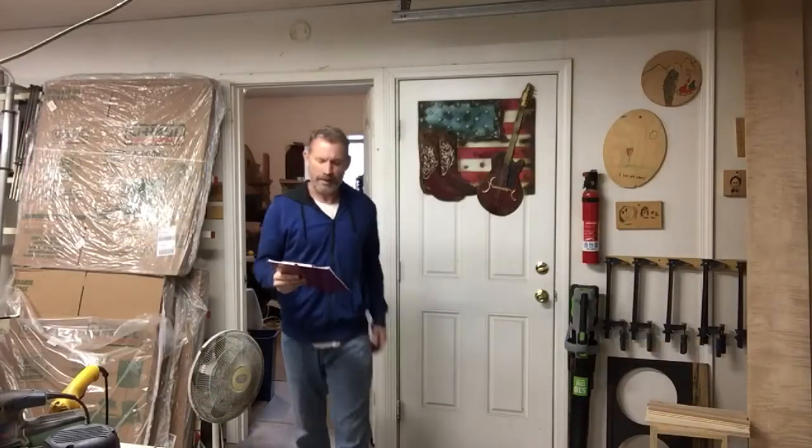All right, so what we've got here today is a 112 OSZ. The OSZ is basically like a Dr. Z Z-Best 1x12. So we're going to build this one out of pine, dovetail jointed pine, with birch baffle, birch rear panel. Customer opted for the standard 2-panel open back, semi-open back. And we're going to do that. 1/4 inch jack, all the standard hardware to match his Dr. Z Carmen Gia.